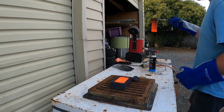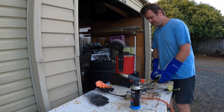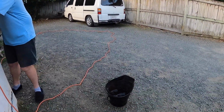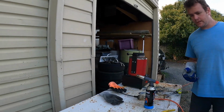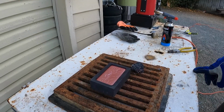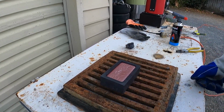So what I'll do now is we put the crucible back inside this furnace. And there's leftover remnants, if you will. And then what we do, guys, is we close the lid, turn it off. In fact, you could have turned it off before you poured it, but either way it doesn't matter. And we let it cool down so that the crucible and the internals of the furnace cool down at the same time. That way it doesn't run the risk of any cracking because things shrink too fast or cool down too fast. But as you saw, that was a beautiful pour.